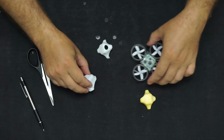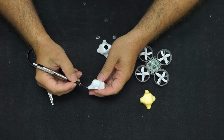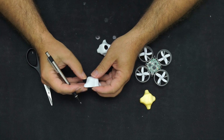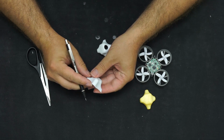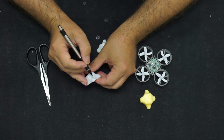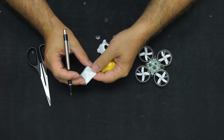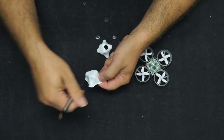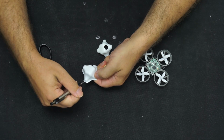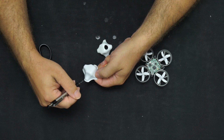Remember, I was saying in the vacuum forming we were going to have this fillet that would happen. You can see how it has a little bit of a curve. Let's see if we got a better one. Yeah, here we go. You can see right here how it curves, but it makes no difference because our cut line is above that. One thing you can do if you're having that is, after it's been vacuum formed, use your heat gun and blow right into the corner right in here, and it'll suck down further into there if you need it a little bit further down.